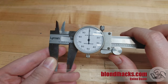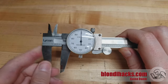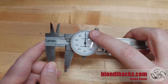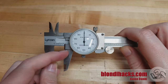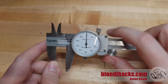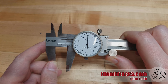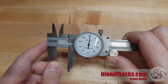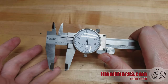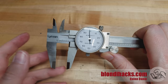This is an imperial caliper. It's marked in inches, so these markings here are each 100 thousandths, and then the dial is marked in thousandths — one lap of the dial is 100 thousandths. So as I travel along and when I hit the six, that's 600, and then that guy hits zero, and we are at 600. Very quick to read. You typically don't get a lot of read errors with this tool compared to some other tools that require more brain power to read. It's much easier to make a mistake in the reading with those other tools.